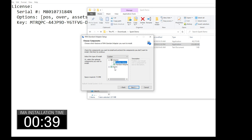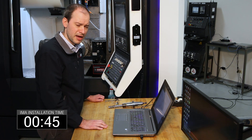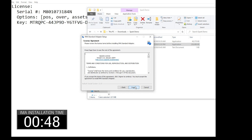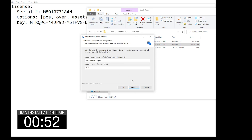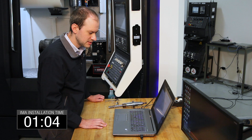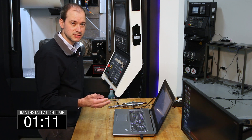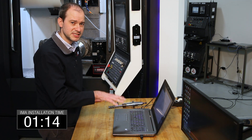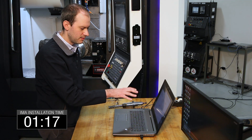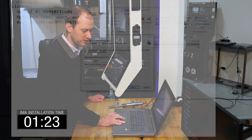A couple of license agreements. Now I need to put in what I want to call this service name for the adapter. I'm just going to leave it at the defaults because I only have one machine. If I had many machines, I'd want to give them different names and unique port numbers as well. The standard default port for MT-Connect adapters is 7878. Same thing — we also have to put in the MT-Connect agent; just going to leave it at the default MT-Connect agent and port 5000. If you have multiple machines, you're going to want to give them each a unique service name and a unique port number. The installer will help by double checking to make sure that the ports you're choosing are open so that you're not trying to install something where there's already a program running.